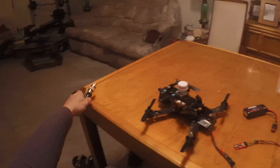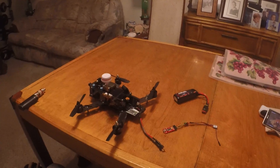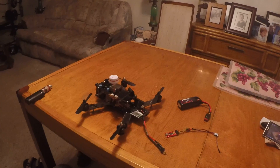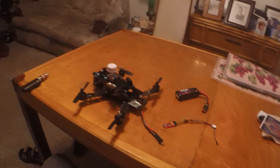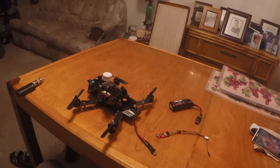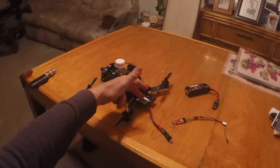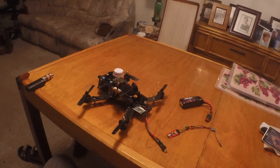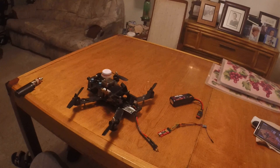Welcome back to RC Surf Shots. Got a little update here - we'll talk about the Bluetooth module for your flight controller so you can use your phone to adjust settings, basically everything you would do on Cleanflight in the field. About two weeks ago I saw a video on Painless360's YouTube - I'll put a link below - and he very easily and simply hooked up the Bluetooth module using an FTDI connector with a couple of simple settings and voila, he was hooked up.